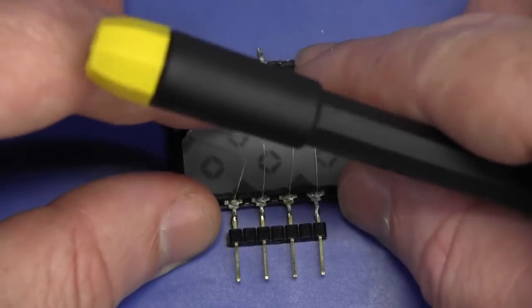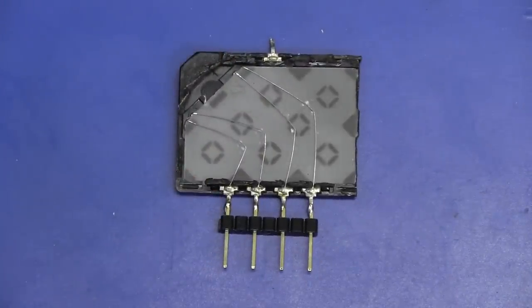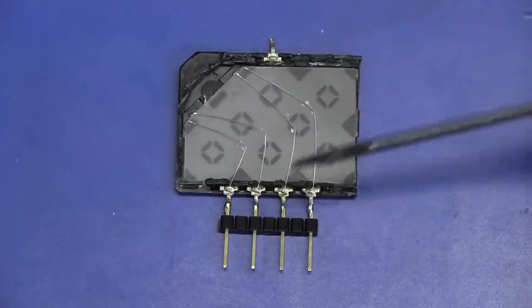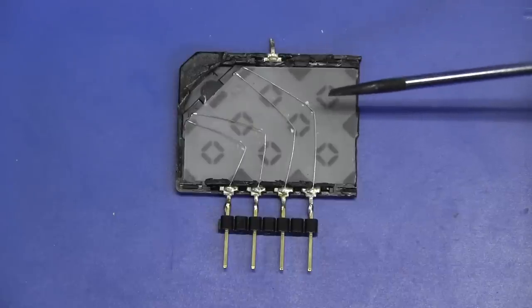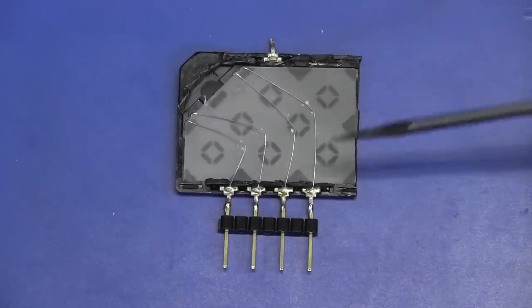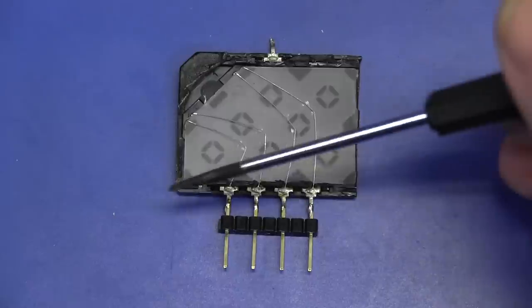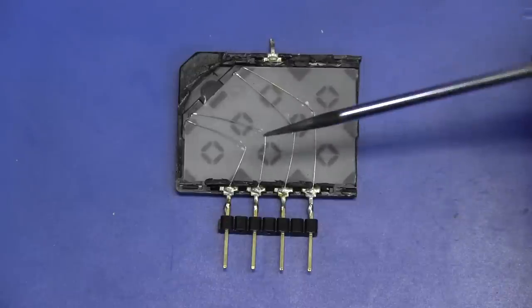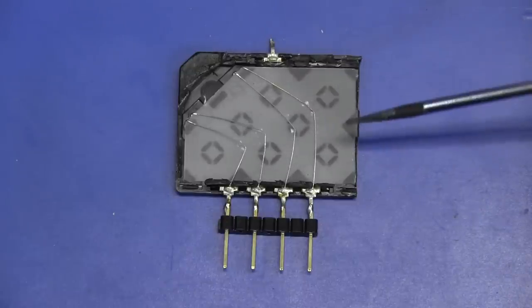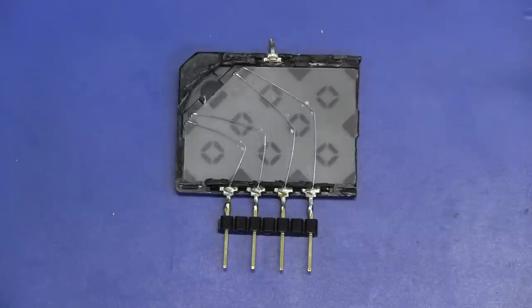These potassium lead silicate glass delay lines have an approximate wave velocity inside the medium — and it does travel inside, it doesn't travel on the surface — so even though that epoxy is on the surface, it's just used to dampen the wave inside the thing and keep it channeled within that particular waveguide function. Because it's folded back and forth with this convoluted path, you need those dampeners in there just to help concentrate those shear waves inside the glass.